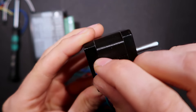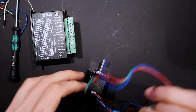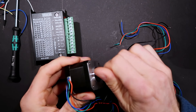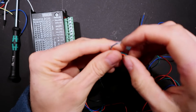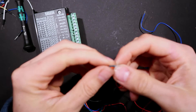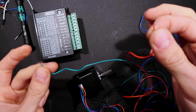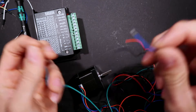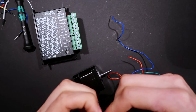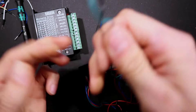Let's put this back together and see if we can let the smoke out. The black wires are pinched between the motor casing and the connector — that's not good. I don't have a multimeter here, so I'll show you how to figure out phase A and phase B without one. If you spin the motor it spins freely. Take two wires and short them together: if you captured one from phase B and one from phase A, nothing happens — it'll still spin freely. But if you short both wires of one phase together, it gets hard to spin. That's one phase — and shorting the other two together is the other phase.